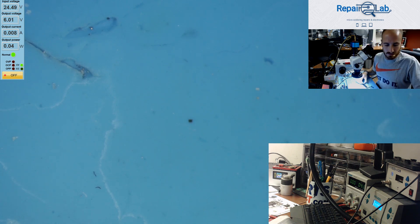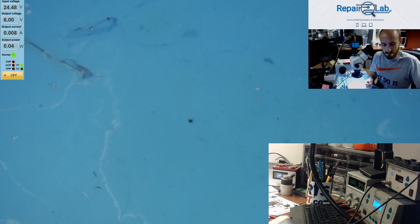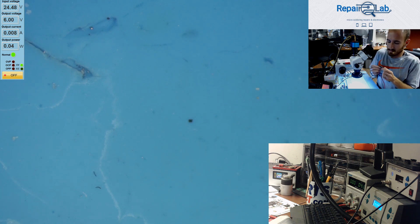So let's connect the device to the first power supply with the three digits. There's the 7 Plus connector — connecting now — and as you can see there's no consumption at all. And if I try to power on the device, the device will boot, but we're facing those random reboots so I won't let it complete boot. I'm connecting the logic board and no consumption is shown on the DC power supply.